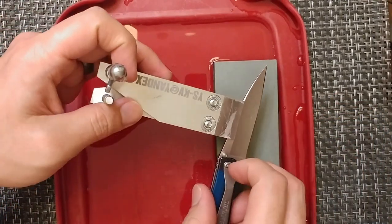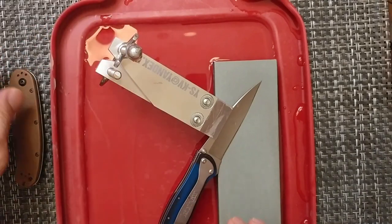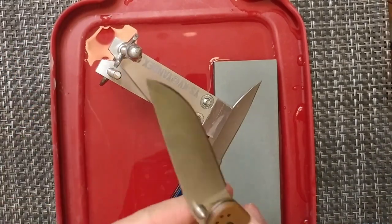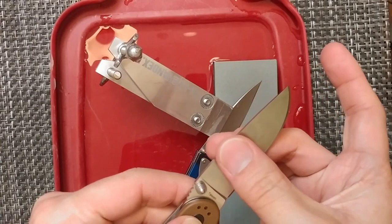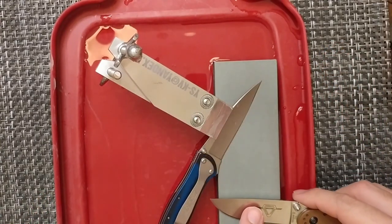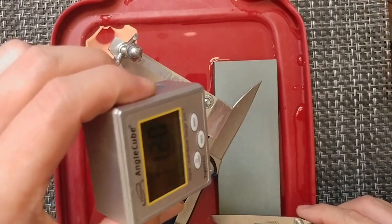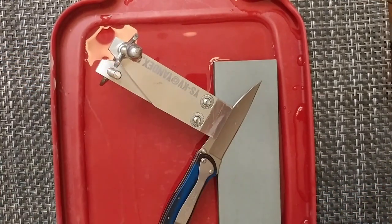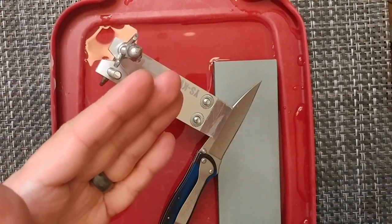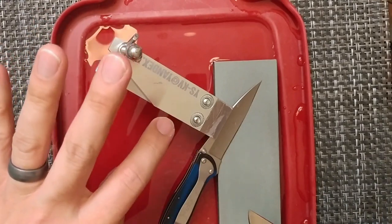The reason I have the RAT2 out here is because that's going to be the flat grind. You need to account for the angle — basically put your prying knife on a flat surface, get the angle for it, and then take half of that number and add it to whatever number you have for the actual system.